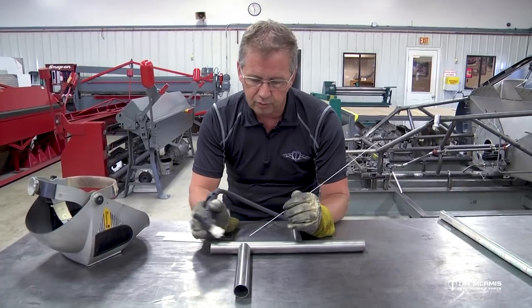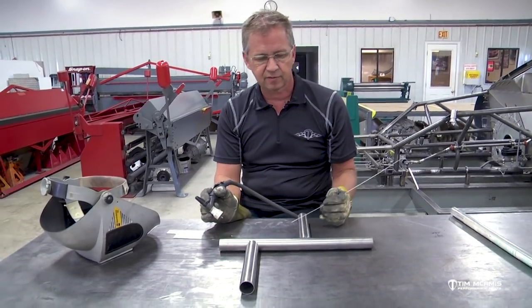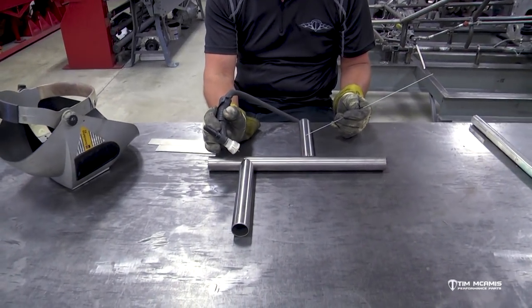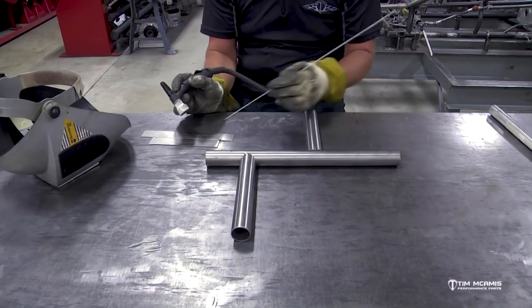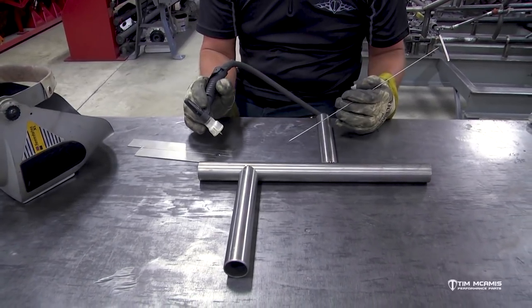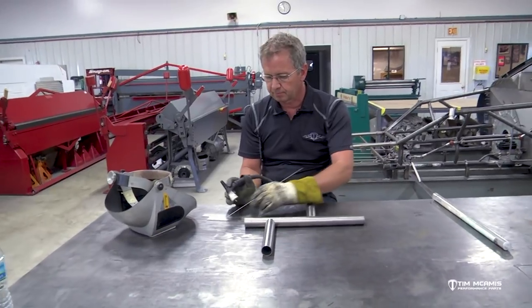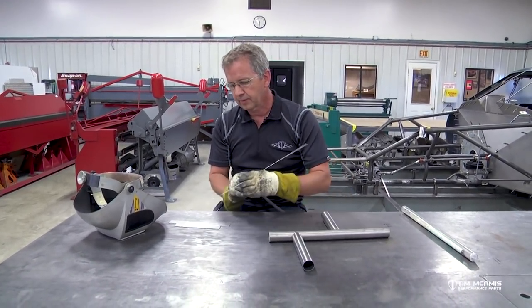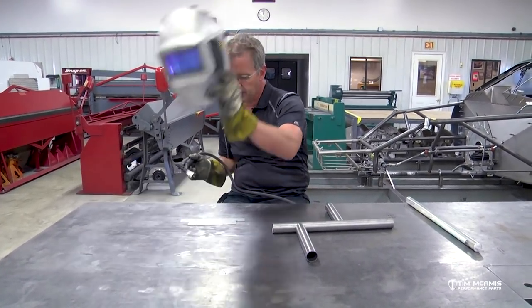It's definitely easier to stick the rod on your tungsten and get your tungsten in the puddle. But with a little bit of practice, it's not a problem. I've gone ahead and tacked this stuff up — same process, I just zip tacked these. I just hit this with a pedal and knocked them together without any filler rod. Same way with this little flat piece here. I'm gonna go ahead and show you a couple of welds on this flat piece that don't have the proper argon coverage, and then some with, so you'll get a better idea of what that looks like.